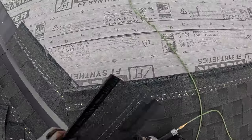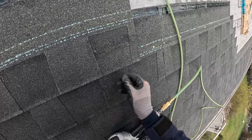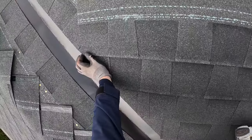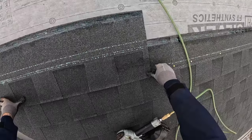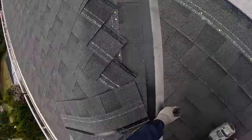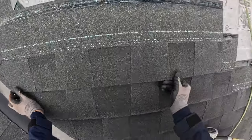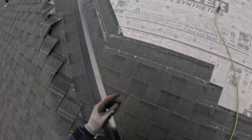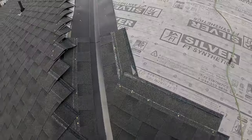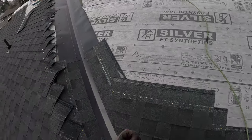Now these California speed valleys might not work in super ice-dammy areas, you know, Northern Michigan, Ontario. They might be fine, but I've never had a roof leak, especially not in the valley. So if you're having issues, it's probably something else, something that you've done. Yeah, you can cut valleys, you can weave them. But this contractor likes open valleys.